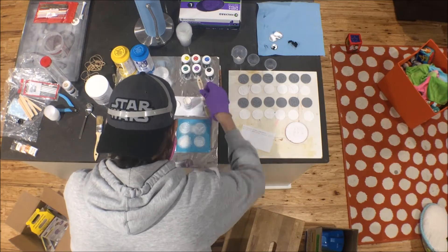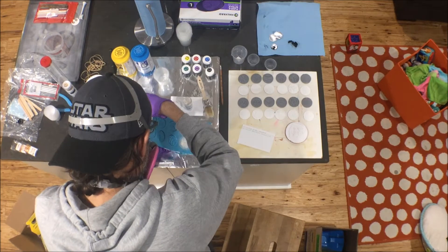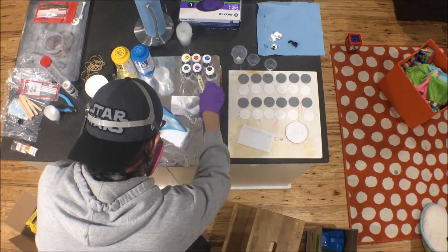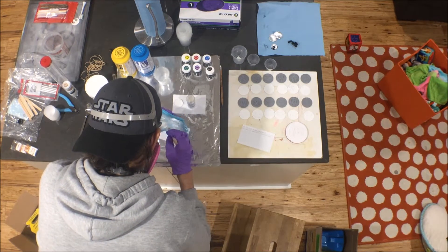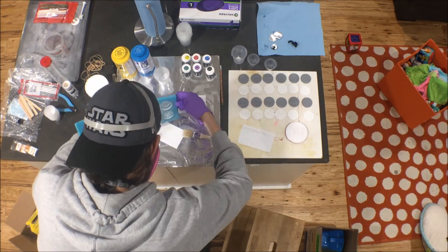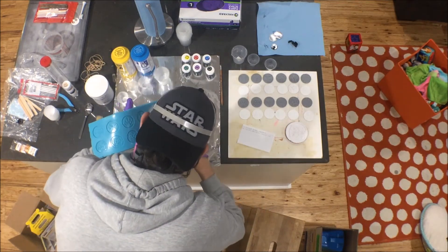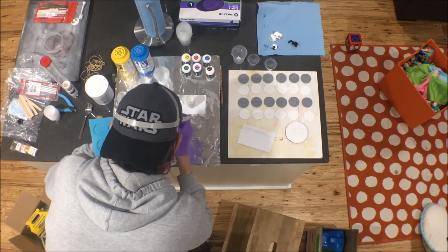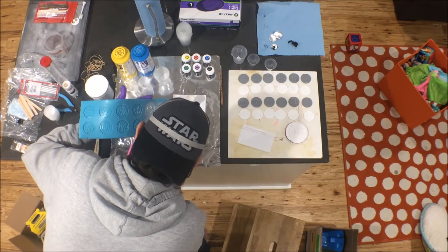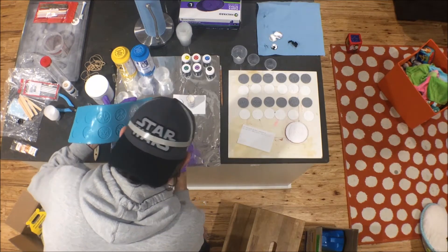Once you're done, you want to clean up and tap out your mold. My mold stuck to the foil a little bit, but I fold the note card in half so it'll be easier to pour the powder back into the container. I use the brush to kick out all the extra onto the note card, tap it a bit to get out any extra, and do a little more brushing. You don't want any clumps because that'll inhibit curing and make your casting not so great.